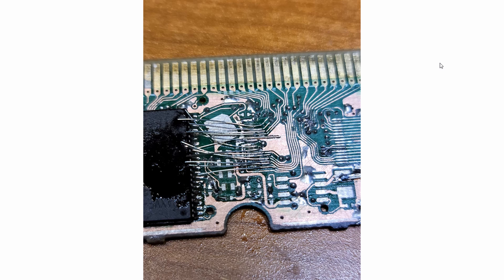You may be wondering why I didn't show the process of soldering the flash chip back on — and that's because it was more of a challenge than I thought it would be. I was kind of stuck with how to put it back on. The issue was that these solder joints created by the jumper wires added a bit more height to the package, as it did with everything else, such as the real-time clock chip. With the flash chip, it was too much height to allow the leads to bend and still solder on both sides, so I had to get really creative. It took a few tries to land on something, and I didn't want to record the process because I didn't know which part would be used.